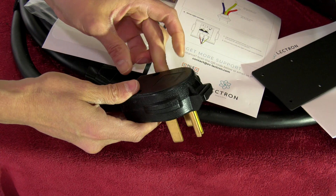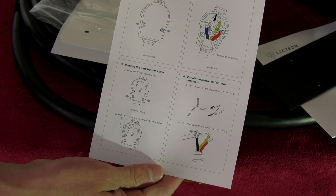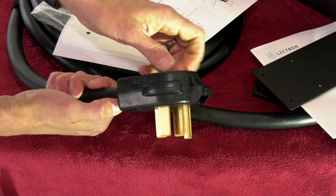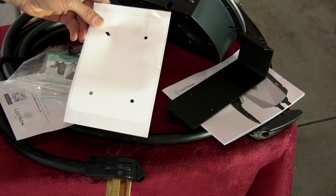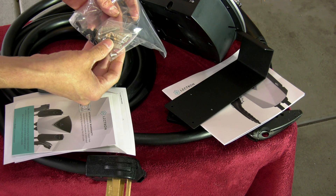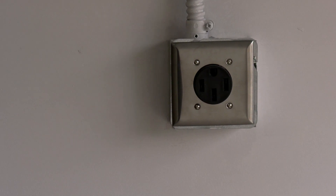They've included the NEMA 14-50 plug here, and they've given you instructions that if you do decide to hardwire it into an outlet box, they're giving you instructions on how to remove the actual plug. And when you do so, it unlocks the mode which lets you pump in 48 amps. There is a sensor inside this outlet that, once you remove it, will let you do 48 amps. Otherwise, if you're just going to use the NEMA 14-50 outlet, it's going to get capped off at 40 amps — and it's really for safety reasons, especially in the summer. When you're pumping in 48 amps, the outlet or the plug tends to get very, very hot, and in some cases there's scorching around the terminals. I don't recommend bypassing it. Just be careful.